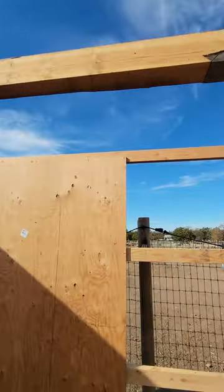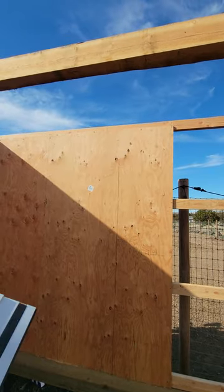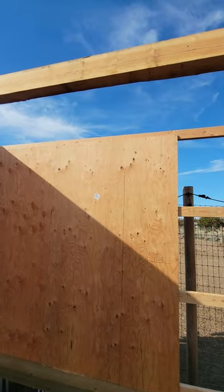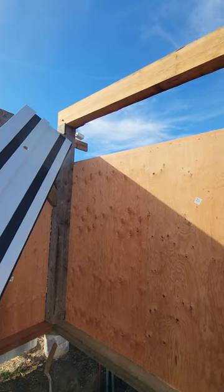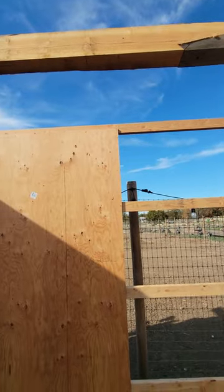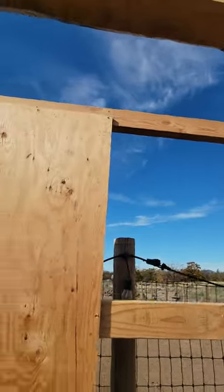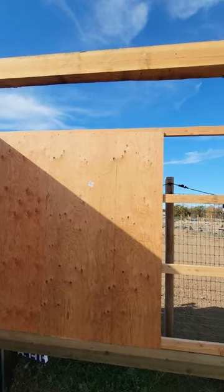Another use: you can see this plywood falls right in the middle of a 2x4. I wasn't initially planning on putting this 2x4 rail here — I'm putting up a barn door that slides, so I need a 2x6 above it. The plywood went almost to the top corner of the barn, and then we decided to put a door in back, so I took the track, lined it up, and cut that whole section while it was up on the wall. I just had to move a couple screws below my cut line first.